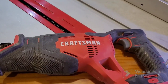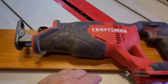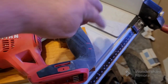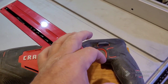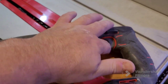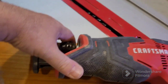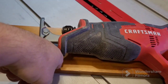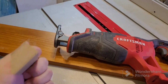So here's the plan of attack. This is the board I showed you earlier. I'm going to cut this to about yay long - it comes to the edge of the handle. Then take another piece, transfer that onto here and try to shape it so that it fits in and holds this quite snugly. Then maybe a dowel here and there just to help support the weight, and then whack a French cleat on it - 45 degrees chamfered down so no dust gets in behind.